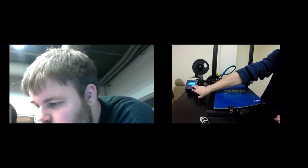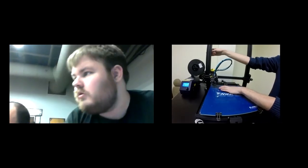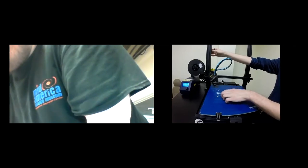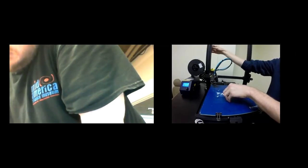Click the button, go down to Print from SD Card, and select the gear 50mm file I saved. Since my nozzle is hot, I'm going to raise my X-axis up so it doesn't burn the build plate. If the nozzle is hot and sitting right next to the blue build surface, it will burn a hole in it — so beware. Just take your right hand, turn the back spiral to the right, and it should raise your X-axis up.